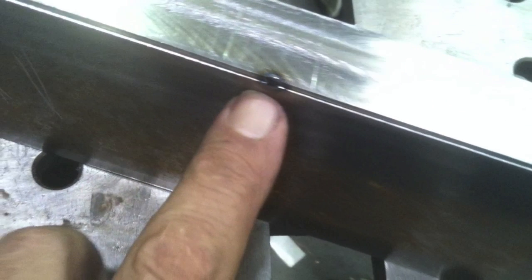This is the way I like an outside corner joint — no gap and just a little overlap — and that way you can weld it even without filler, just rolling the corners over using minimal heat.